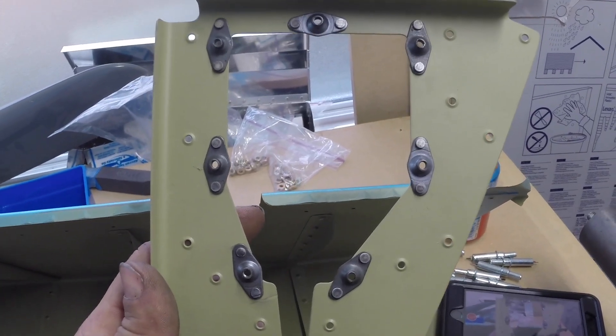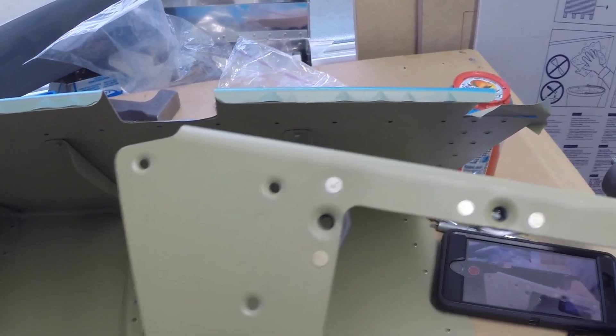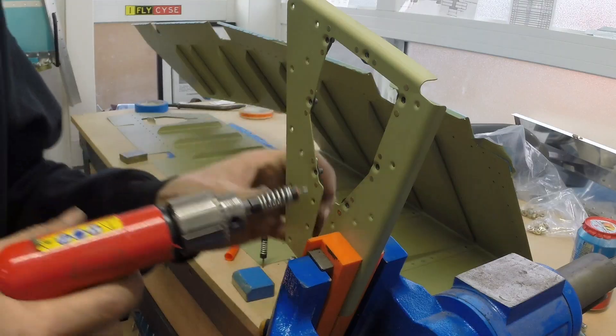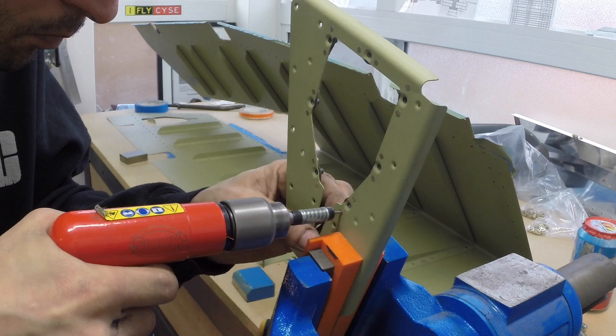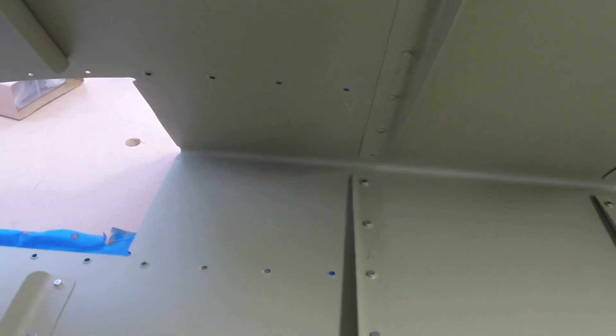Here it is from the back side — and again, that's the one we're going to replace. All stepped in — not cool. We got some stuff done. I've got some rivets marked out that I'm going to drill out. I really have to figure out a decent way of getting all the way back into that root — it always seems to be an issue when it comes to dimpling or riveting all the last rivets down into the roots of bends.